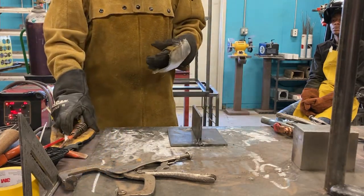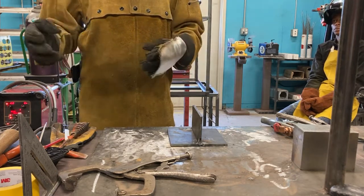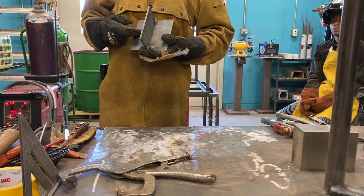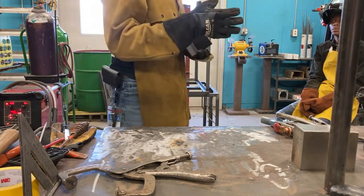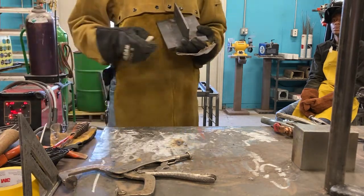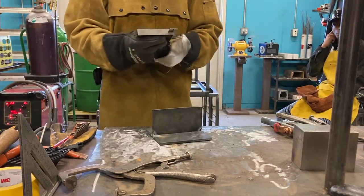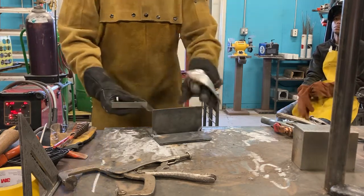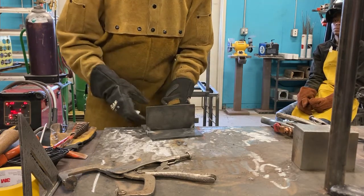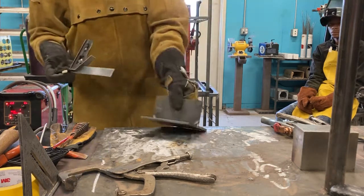Now, before we begin, we want to remember things from how we start our arc. On this, we want to go just halfway down. Okay, we're not going to do the whole plate. We're going to go with halfway, all right? So before we begin, let's lay it out. Get some chalk, some soapstone, and actually lay out your guidelines. Like, how far down do I need to go? And actually put a border down there so I know where to stop. Okay, I'm just going to eyeball this for the sake of time constraints. Here, so I got my line down.